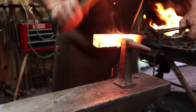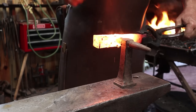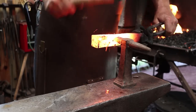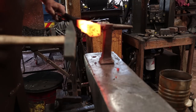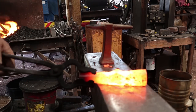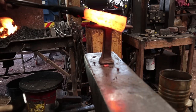Using a very light cross-peen just to try and blend that. There's also a risk of burning this a little bit. There's a real risk with trying to bring thin material up to welding heat. If we're going to save it, it's saved. If we're not going to save it, it's just not going to happen. Because that's the last I'm going to do with that.